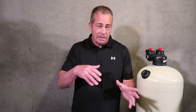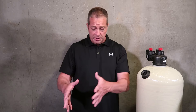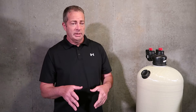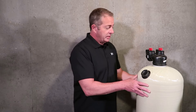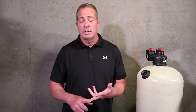A lot of times people come out to your house and give you an estimate — they really don't understand. They're just trying to sell you equipment, but they're not experienced as far as servicing, installation, and the in-depth water testing that a true water treatment professional has experience with. Getting back to the backwashing system, the cons are the wear and tear on the valve and having to replace components within the valve itself.